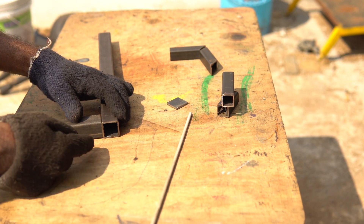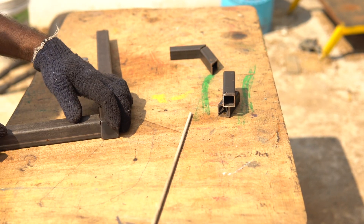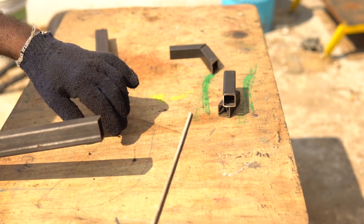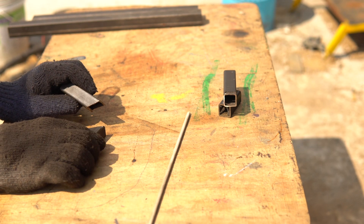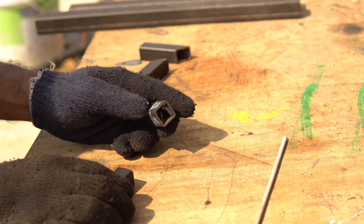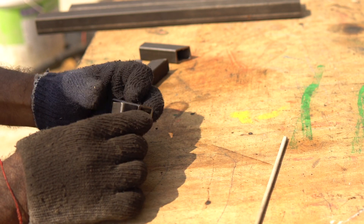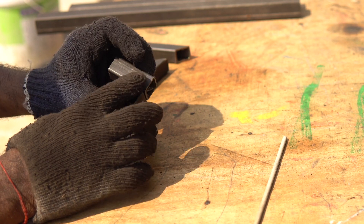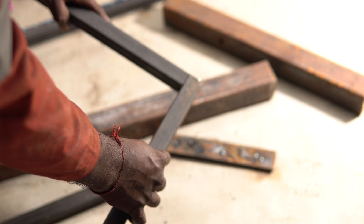Another issue is that a hole forms after welding a T-joint, which becomes a haven for insects and must be covered. You can weld a small piece of metal there, but that piece has a thickness of 2mm which again needs to be compensated. To counter this, you can either use a mitre cut — where the length and breadth of the workpiece won't be altered — or remove material from three sides of one pipe and use the fourth side to cover the second pipe. The overall length may extend by only 2.8mm, which is negligible.